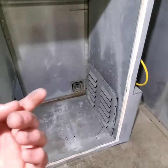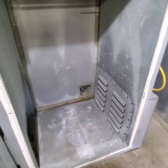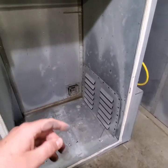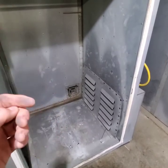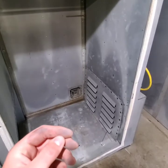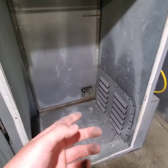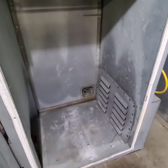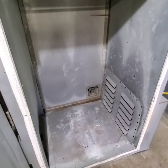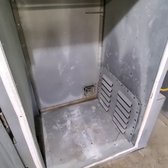The baffles take longer to heat up so we leave them out most of the time — unless we have a really tall part. We went about a year in this oven before the big oven was even an option. The baffles can be screwed down in a couple spots, still letting some heat through while keeping direct heat off the part, which gives much more uniform heat from top to bottom when cooking tall parts or several parts hanging one after another. If your elements are in a convenient spot for this I'd suggest making baffles — otherwise just run without them and learn your oven.